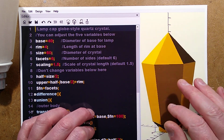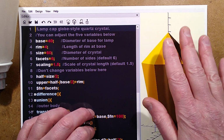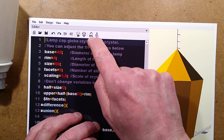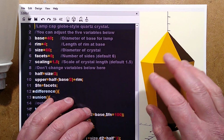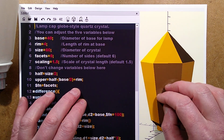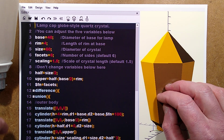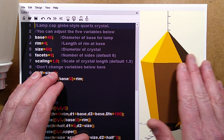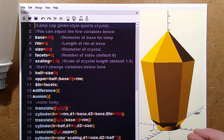And when you scroll around it, you'll see it's there in much more detail, so to speak. And you can then click STL, and it will save that as the STL file that you can then put into Cura or whatever your 3D printer uses, and you can convert it into the file for 3D printing. I used Cura and I used an FLSUN Q5 for these. It was very effective.